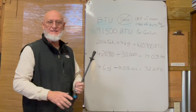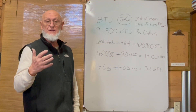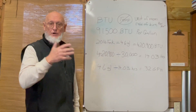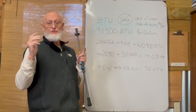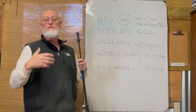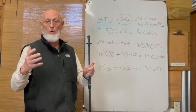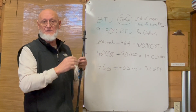So if you had something that hypothetically burned 100 BTUs, it means that it would burn 100 BTUs over an hour's length. If it's at 30,000 BTUs — which is the heater I've been burning in here — it's going to burn 30,000 BTUs per hour. Now that doesn't mean anything to us yet, but we've got to convert that to gallons.